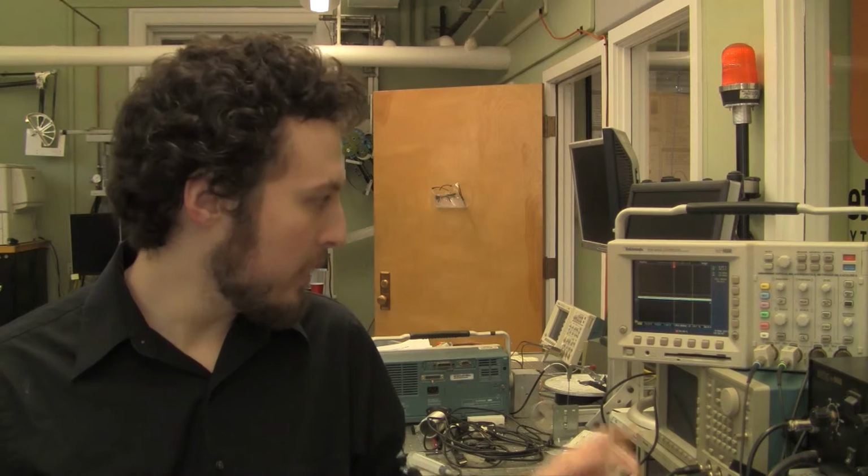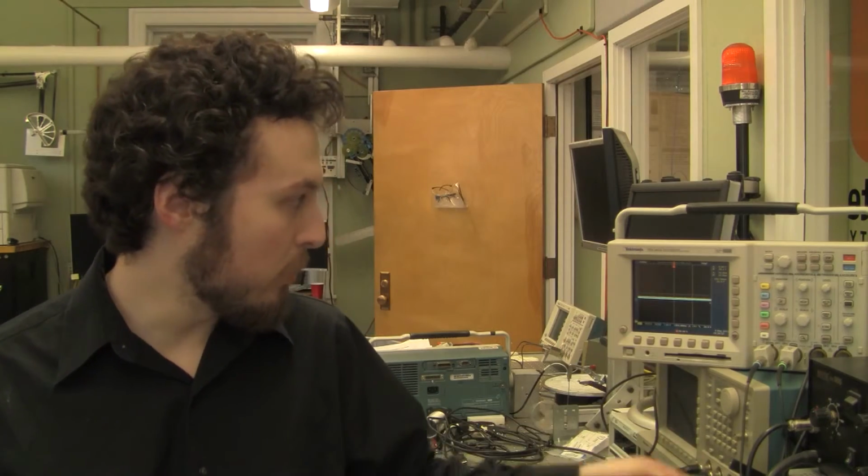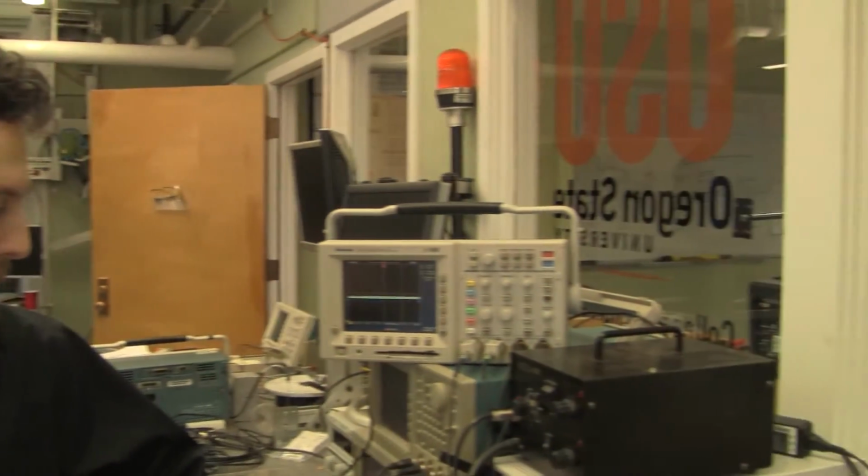Now we'll do the undervoltage test. So we have the ThunderBox set up again, running at a little over 30 volts, and we'll turn off the power supply and drop below 30 volts, and we'll see it on the scope. Once again, we need to hit the 10 millisecond window.